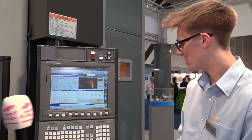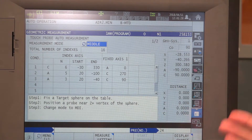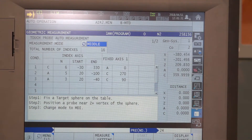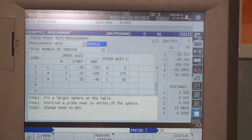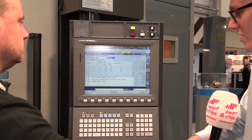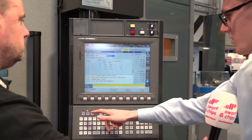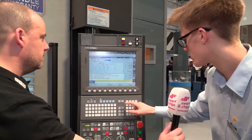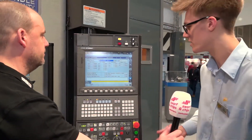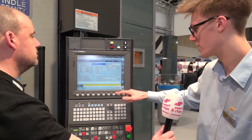Where does it feature on the control? You click what you want to do, then click go and it does the rest - probes the sphere and then compensates. It's a pretty unique feature for Okuma. On the screen it tells us step by step exactly what to do: step one, fix the sphere to the table by a magnetic base, position the probe near the vertex of the sphere, change mode to MDI, and click start measure. The results show in the table - result without compensation and result after - then you click update and it's done.